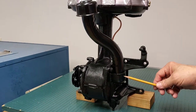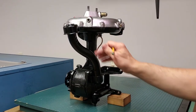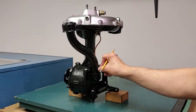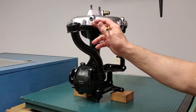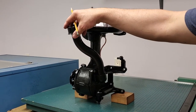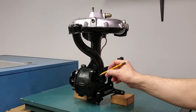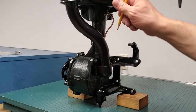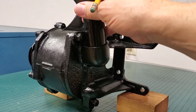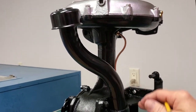This tube up front on this 1939 supercharger is the oil fill tube. When it came in, it was installed upside down — somebody had drilled holes in both ends, put a screw on the bottom and a chain-held cap on top. The cap is actually spring-loaded and doesn't need a chain. The way you know which end goes in the bottom is that the bottom end is serrated — the serrated end goes into the casting at the bottom. It should be possible to pull out by hand but not loose, because the serrated end holds it in place.